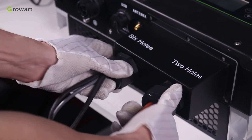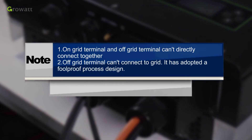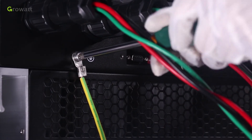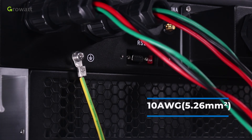When all communication lines are installed, push the waterproof cover into the bottom, lock the screws fixed to the frame, and finally lock the waterproof cap. Note for communication cable connections: the CAN battery communication and RS485 battery communication cannot be installed at the same time. If cables such as RS485 or CAN are not used, do not remove the filler plug from the cable support sleeve. For grounding, SPA series must be grounded by cable. The minimum grounding cable wire diameter is 10 AWG (5.26 square millimeters).